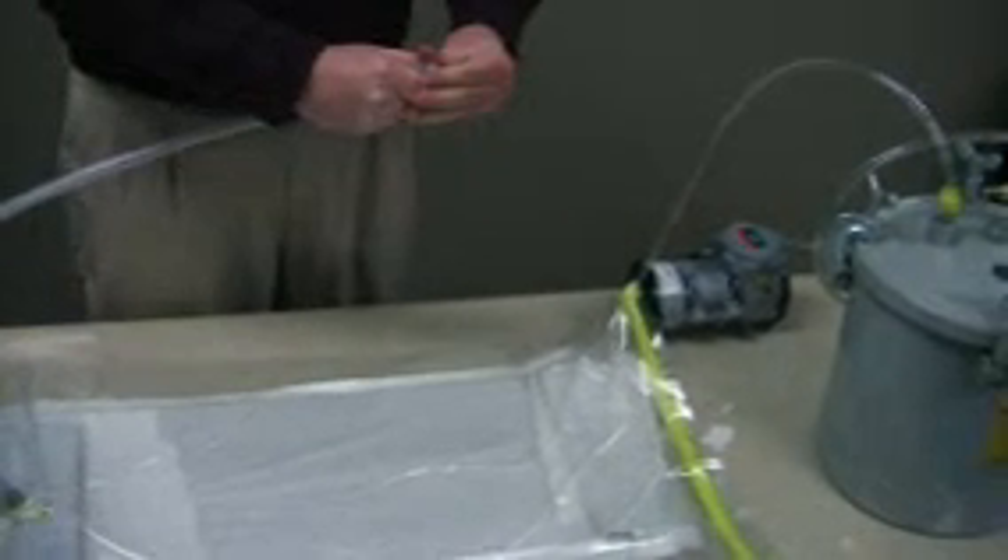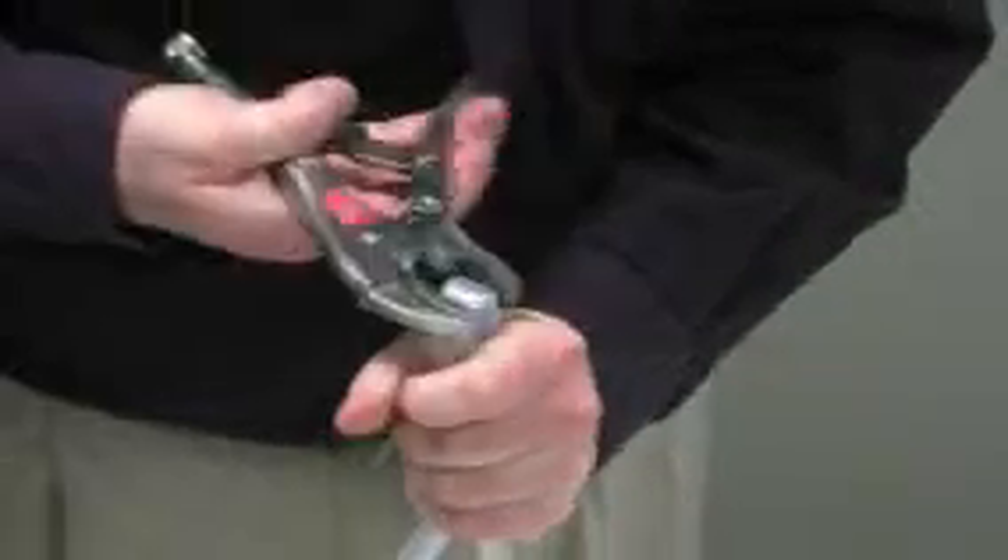As you can see I'm actually pulling vacuum. My gauge is a little bit to five and growing. My T-fitting is sticking straight up ready for me to put my hose in place. Now I'll turn the pump off and take my big scissors. Make sure it allows you to have a full seal with the bag tape, hose, and T all in one. Now I'll turn the vacuum back on and pull full vacuum. You have to crimp this hose down so no air gets into the part — the tool we use for that is vise grips. Right now we're just testing to make sure we have a full seal on this part.